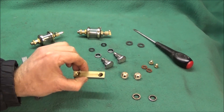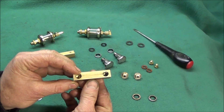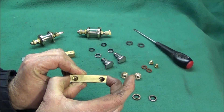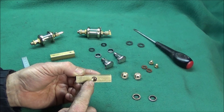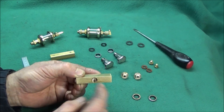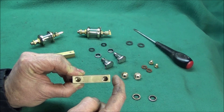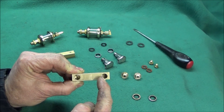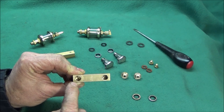I made my manifold block out of a piece of half-inch square brass and it's 57mm long. The underside port is in the centre, and the top ports are 8mm in from the side to the centre, and they're all 1/8 BSP thread.